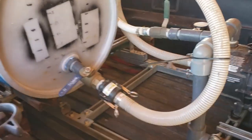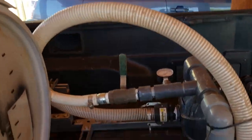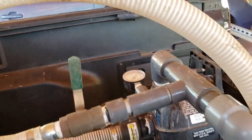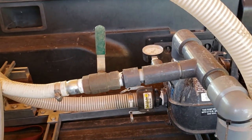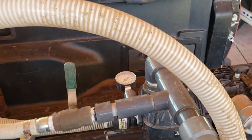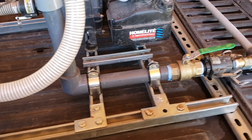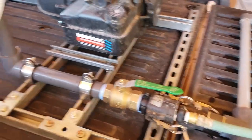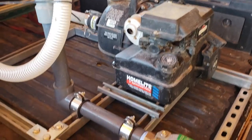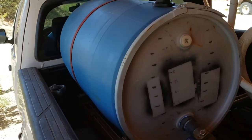It's pretty simple — just a valve coming out of the 55-gallon drum, and that hose is the intake for the pump. That's your suction side. Your pressure side has a valve in it. You can move that valve and get the system up to about 50 psi pressure once you close the system, and then you just go out with another valve. It's a standard agricultural water pump. Use the Unistrut in the bed to hold it all in place. Elevate the drum and slope it.